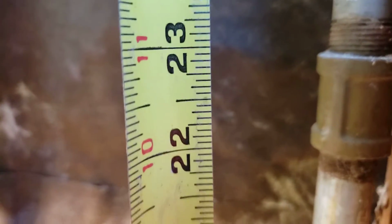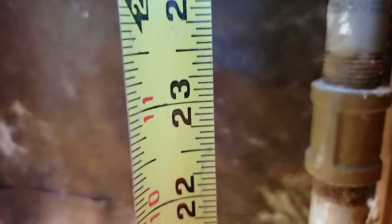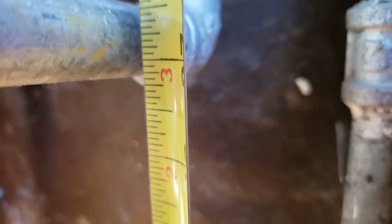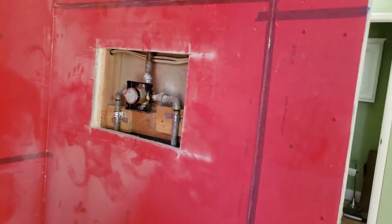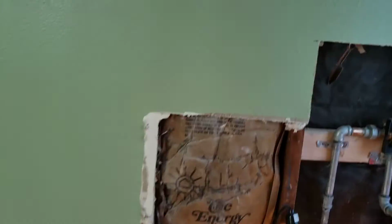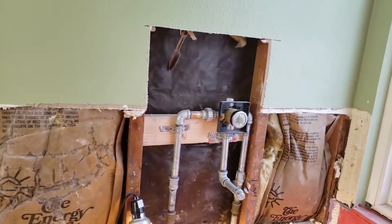So tub, and of course they said plus or minus a 1/2 inch on all their dimensions. But if your tub's 24, we've got you up at 27 1/4, which puts you 3 inches above, and so you're fine. Tub spout's is in a great spot. Valve's in a great spot. That was already predetermined, and you don't need any tolerance there. That can be anywhere from 42 to 48, so that's good. Anyways, again, everything here looks good. Outside of that, this installation is done.